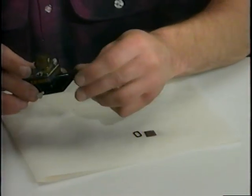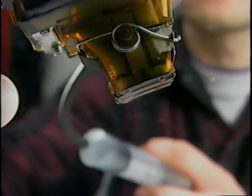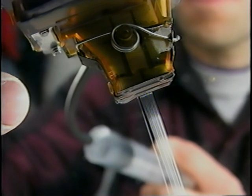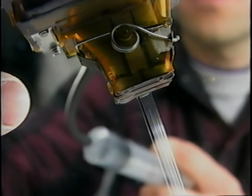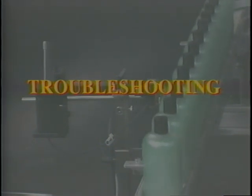Reattach the syringe and run solvent through the printhead. This should produce 9 distinct individual streams shooting from the array plate. Troubleshooting. The troubleshooting guide will try to demonstrate some of the most common causes of poor quality printing and how to prevent them from happening.